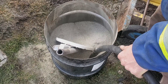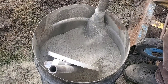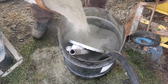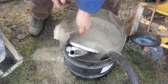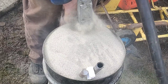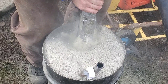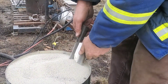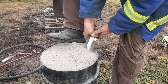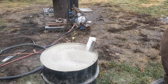One thing I found is that before I was using a reciprocating saw, but this concrete vibrator I came across is working amazingly. It packs the sand right tight the way I want it and I don't have too many air pockets left when I'm done. The one major thing is it kicks off a lot of sand dust, so I had to do it outside and make sure I was upwind from all the dust — or wear a mask. I'm packing in the sand, and I did end up getting the rods out — it was kind of a sword-in-the-stone situation.